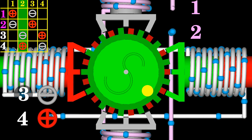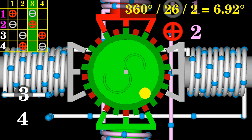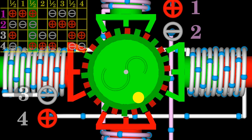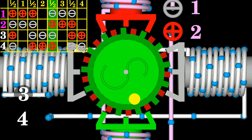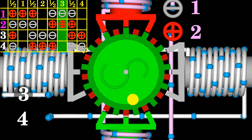The front view illustrates the alignment of rotor and stator poles clearly. In total, the rotor has 26 poles. With each full step, the rotor moves by half the angle between two poles, which is less than 7 degrees. 52 steps are needed for a full turn of the motor shaft. With a half step, the motor spins less than 3.5 degrees, thus 104 half steps are needed for a full turn. This type of motor is called a hybrid stepper motor. The name is derived from the fact that the rotor is composed of two materials: two gears made of soft iron as used in variable reluctance motors, as well as an axially magnetized round permanent magnet.